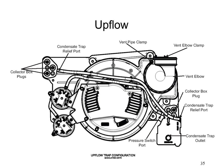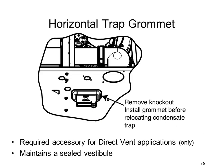If you rotate the furnace to go downflow, the condensate trap that was in the bottom right-hand corner would now be at the top left, which won't allow water to run down to it. You actually have to flip the condensate trap: take it off with two screws, take the three little plugs out, put the plugs where the trap was, and put the trap where the plugs were. For horizontal applications, you rotate the trap 90 degrees in its place. You're either flipping the condensate trap with the plugs or rotating the trap depending on whether you're going up, down, left, or right.